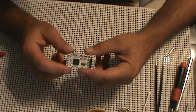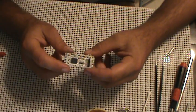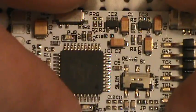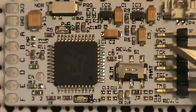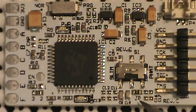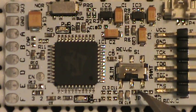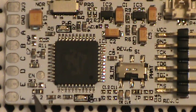What we have here is a CoolRunner Rev-C — it's the latest version at the time of this upload. The first thing we're going to want to do is prep it. There are a couple of resistors you've got to take off first and foremost. Right here we have JP and this resistor is labeled 00 — we want to take this resistor off. Over here, this point is labeled 2 and 3, and we also want to take this resistor off. The resistor has an identification code of 0 as well.